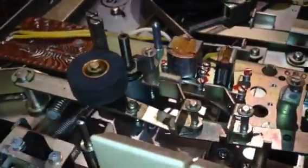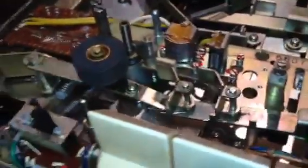I think I calibrated it pretty well. One problem is where the erase head and the play head - they were dirty. I cleaned them. I've got to put the epoxy the pads back on, which I do have. I'm going to take them off and re-epoxy them on. But this glue here is failing. The thing moved in their sockets, which is kind of strange that they'd just be glued in. But I guess that's the way they did it on a lot of the stuff I took apart in the 80s. So what we're going to do is clean those - I know where it goes because I have one here - put a little pencil mark, then clean it all up good.